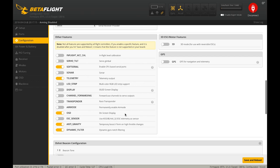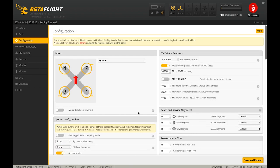On-screen display looks like it comes checked on by default, which is good — the Riot Control supports OSD. ESC sensor: if you've hooked up ESC telemetry to one of your UARTs, that's where you'd turn it on. I found no performance benefit to ESC telemetry in Betaflight. Anti-Gravity, similar to Air Mode, is a modifier to the PID loop that affects I-term relative to fast throttle changes. I turn it on as a feature so it's always active. Dynamic Filter is also on by default — you definitely want that. It's constantly looking at the gyro signal for noise and filtering that out.